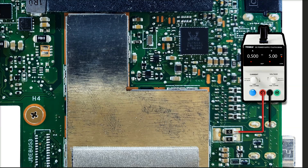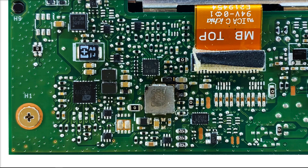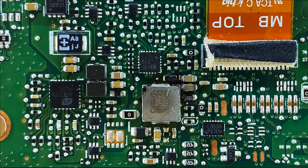When I injected my 5 volts with a limit of 500 milliamps, immediately — without me pressing a power button or doing anything to the laptop — that 500 milliamps maxed out. The section of the board I was looking at initially got really, really hot, just this section right here. So I decided to do the usual trick: put it under the microscope, turn on the power onto the board, put a little bit of alcohol — or lighter fluid, or flux — and take a video of what happened on this section of the board.